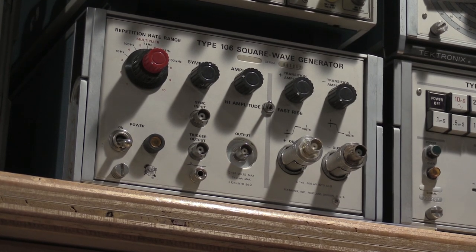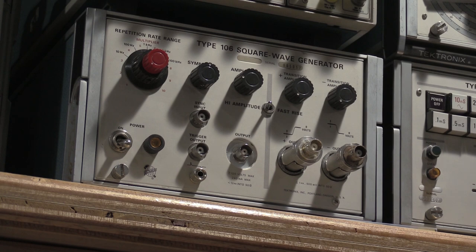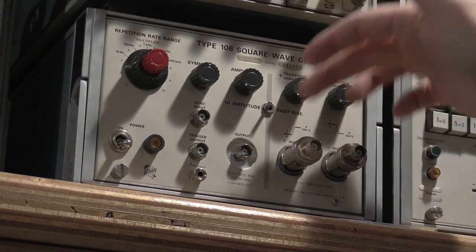First up was the 106 — one of the units I rebuilt, and there's a video out there on it. I could get the frequency dialed in and the wave shape right because the main output doesn't have that fast of a rise time. However, I was limited because I couldn't check the fast rise and fall times on these two connectors — I didn't have a scope fast enough to do it. But I could align the main output to where it was useful: everything's repaired, I'm accurate enough on the amplitudes because of the DMM, and I can go from there.